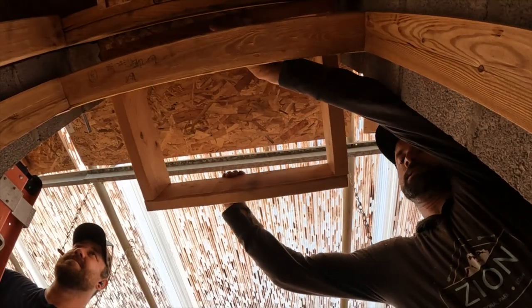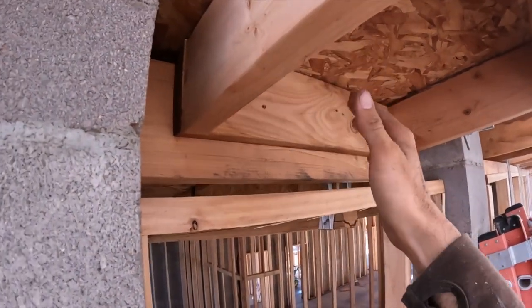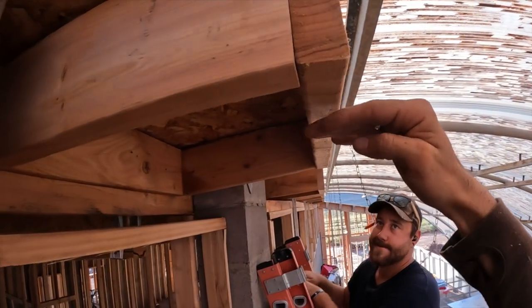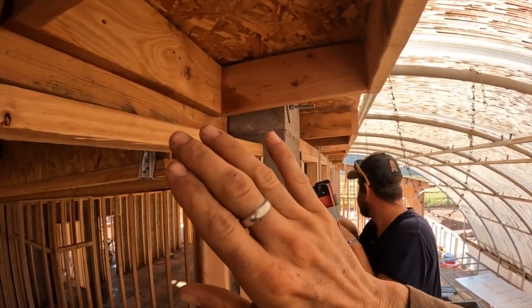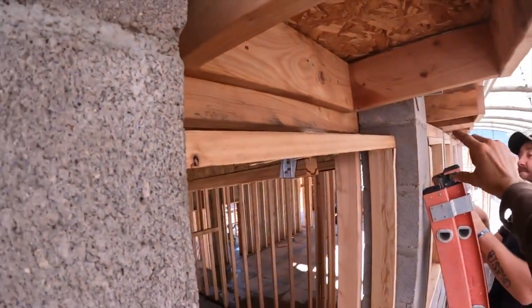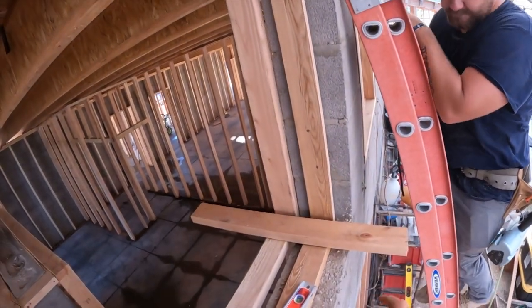Set it up right here. So now that we've got this guy up here, what's gonna happen is we're gonna take our fascia, we'll drop it down here, we'll take our soffit, run it right under, and it's gonna cover up all those bolts. It'll cover up everything that we need, and then on the top pieces for our trim, we'll run little tiny trim pieces across the top. We'll run our siding down, just down the sides of this, and then we'll stop it right there.